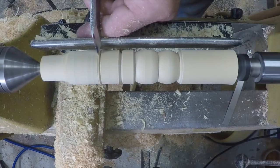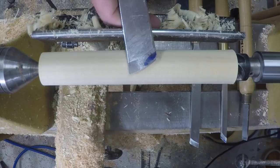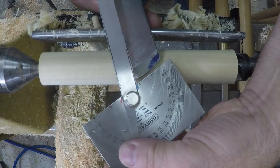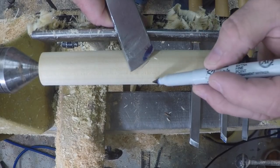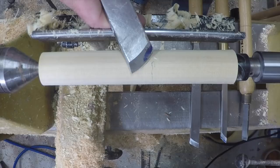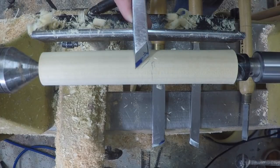In preparation for this video I tried it again — I took one of my old banged-up skews and put about a 50 degree skew angle on it, but I didn't find it unruly this time. After experimenting for a few days, I think I figured out that the wood doesn't care about the skew angle — the angle the cutting edge makes with the tool. It only cares about the cutting angle: the angle the cutting edge makes with the direction of the wood. It doesn't know the difference between a 45 degree cutting angle on a 70 degree skew versus a 50 degree skew.